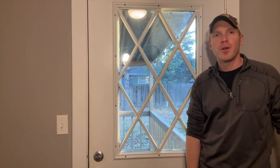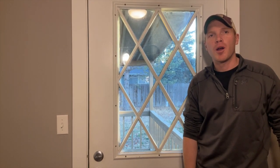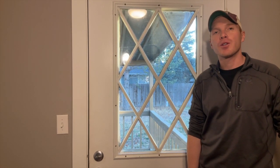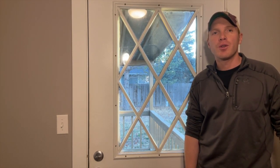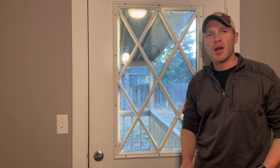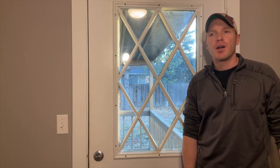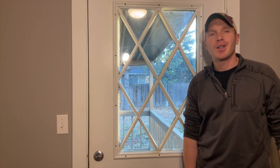We've got the window back installed. The film is on and it's curing. It's going to take a day or two until we're up to full strength for the bond between the film and the window to fully finish drying. We've got a nice secure, shatter-resistant window protecting that lock from the inside. I recommend if you do this, start on a smaller window, get some experience working with the film — peeling that backer off can be especially tricky. Work your way up to the bigger windows in your house. If you've got any questions, drop them down in the comments below. Please like, share, and subscribe for more content like this.